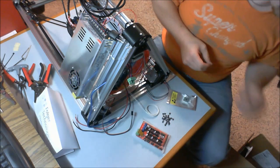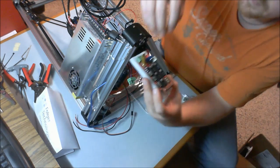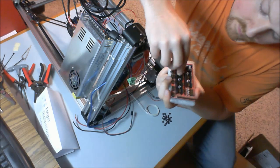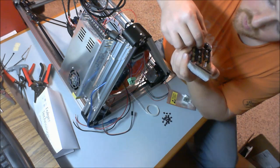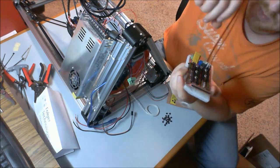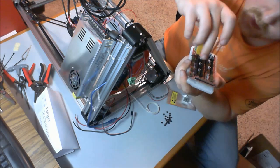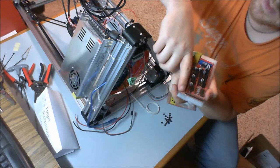We are going to hope for 16 of them. And what you're going to do, here's the green power plug. You're going to fill up the, there's 5 banks of 3 pairs of jumper pins. And you can identify these pretty easily because they are in between the 2 rows of female pins. Disregard this stuff over here on this side right now.